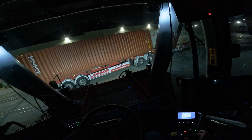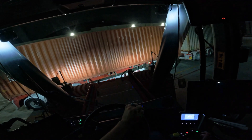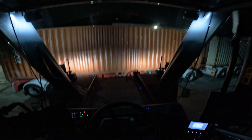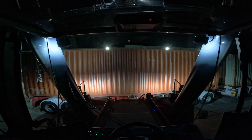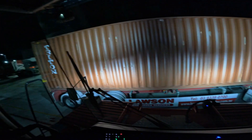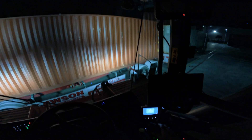What I'm going to do is line up the center of the machine with the center of the container, put it in park mode. I need to push the cabin forward in order to have a closer look at what we're doing. I push the joystick to the left to retract the crane, and then push it forward to bring it down.